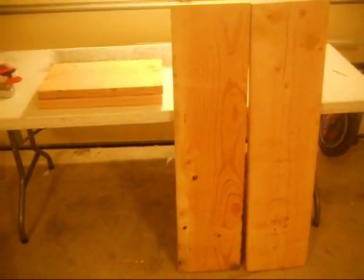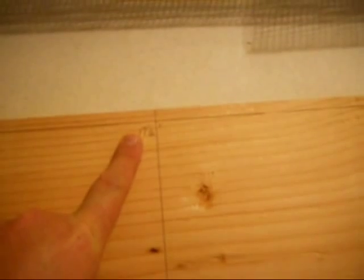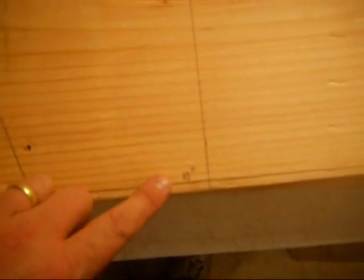The main item that I use is two by twelve inch construction grade lumber. I have two pieces that I've pre-cut. They're nineteen inches long and that will cover the span of seventeen and a half from my top and ten inches across the bottom.